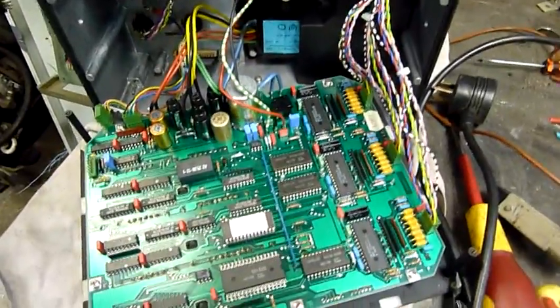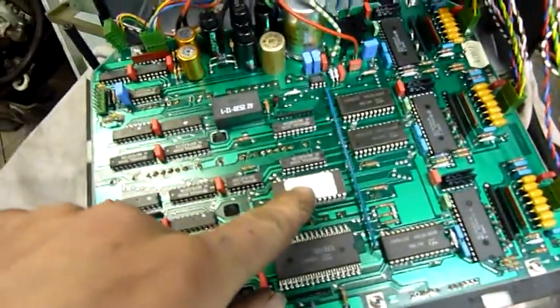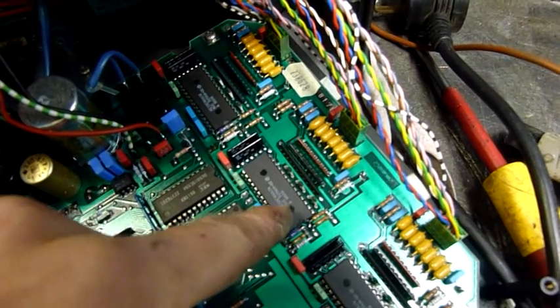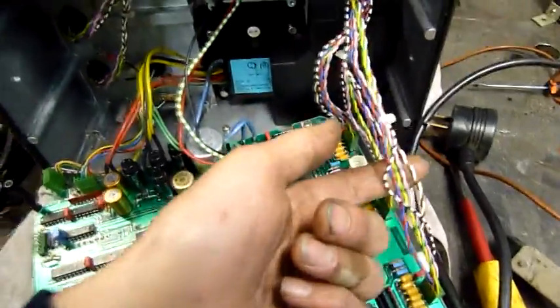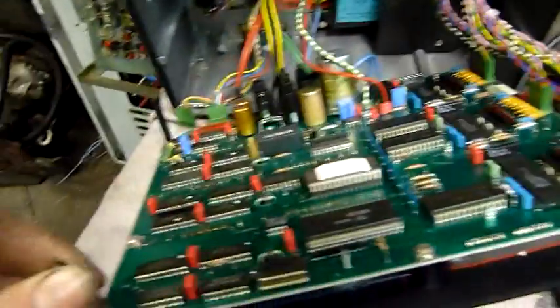So yeah, this DRO is old but it's very well made. Various ROM chips or EEPROM there. NEC D7810G chip. Various Heidenhain chips there. MUC 3256A-02 — there are three of them so I'm guessing they're part of the scale inputs. They all come off these, so your scale encoders feed into each section of this circuit for your different axes — X, Y and Z vertically.